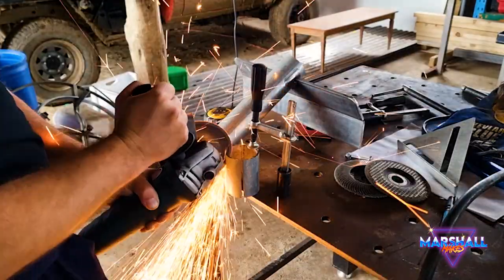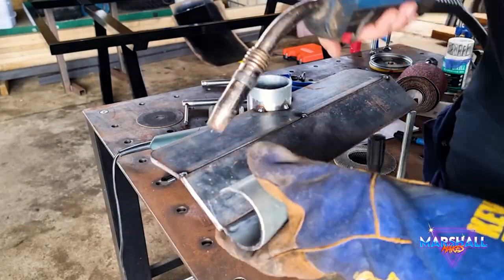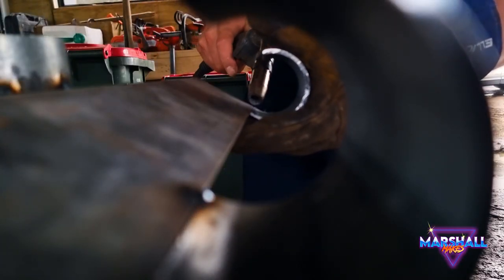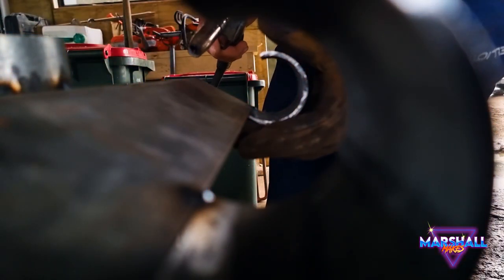This is a relatively easy process, but just be careful when you are cutting the guts out of something, because it can potentially close in on you while you're grinding it and cause it to bite. So just hang on to that grinder and have your wits about you. Now I'm welding these pieces on — there's no real art to it, just kind of chuck them where it works. Just make sure it does fit around the arm of the wheelie bin.